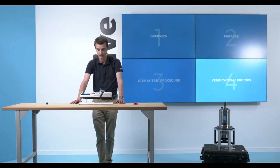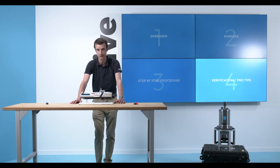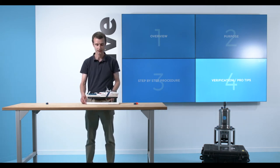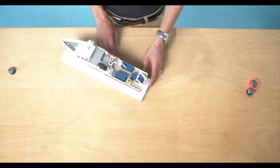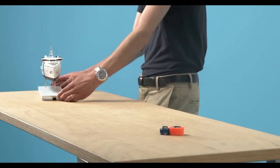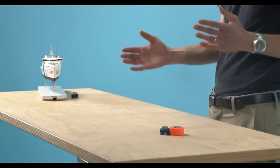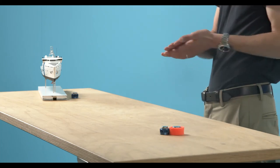The initial alignment is very important. That is one of the main elements that will impact your calibration result. So having the ability to perform this figure eight pattern or stair shape at sea will greatly improve your ability to do this calibration line, and also reduce the time it takes to get those blue values. So with a better initial alignment, you might reach a better end performance result.